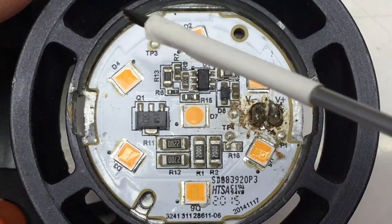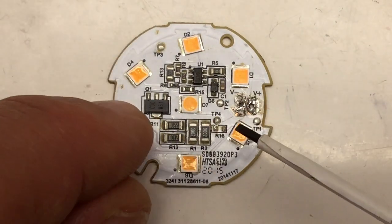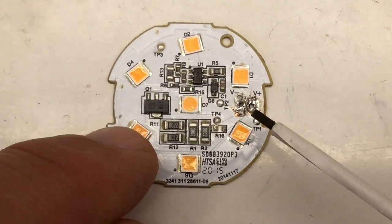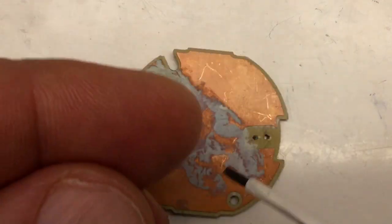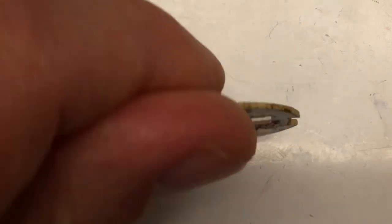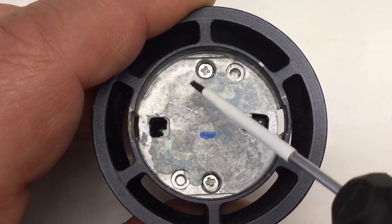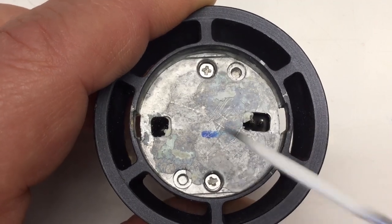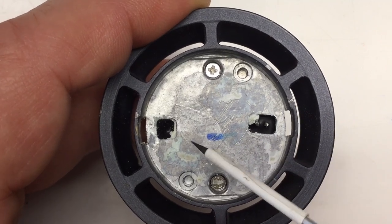These are just test points. Let me try to get the board out. Getting that board out was kind of nightmarish. I had great difficulties desoldering these two wires that came up from the back. The reason being the board has a massive copper plate at the back for heat distribution. In addition, it was glued in with some thermal adhesive. Here you see the two wires, and the copper plate is thermally glued to what I think is aluminium or another alloy back. So this is not plastic — this is actually aluminium or some alloy. Was hard work.